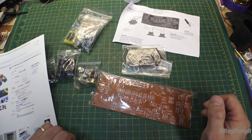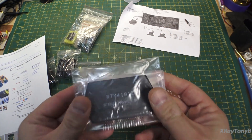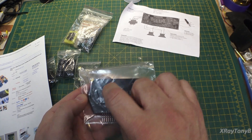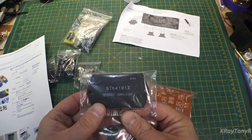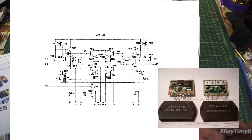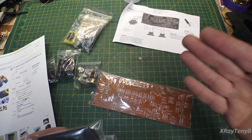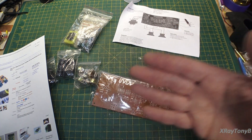From first-hand experience, some of these Sanyo chips that were authentically made by Sanyo in the 1980s had very good — I would even say in some cases exceptional — performance for a multitude of reasons. First of all, when you put all the components close together like this, you have very little lead length connecting the components, and they're direct coupled inside. That reduces noise. Also, all the components are on the same substrate connected to the same heat sink, so all of them run at the same temperature. By having a stabilized temperature of all the components, it stabilizes the performance of the semiconductors. Semiconductors don't like changes in temperature; as you change the temperature, their properties can vary.